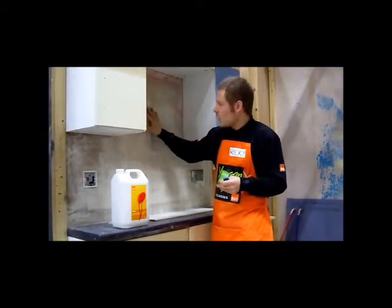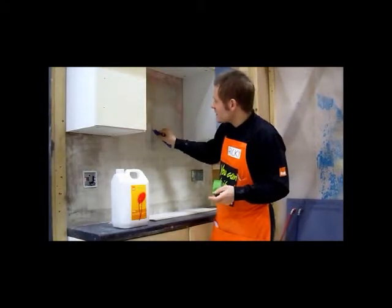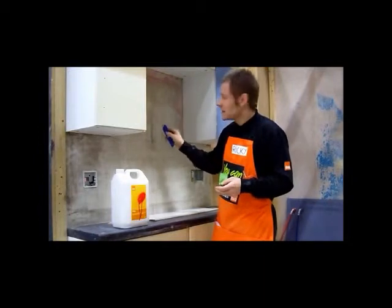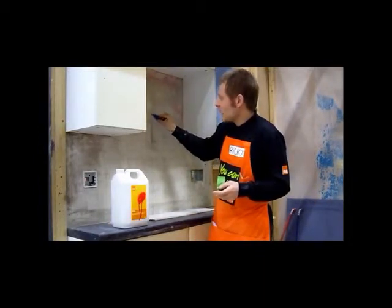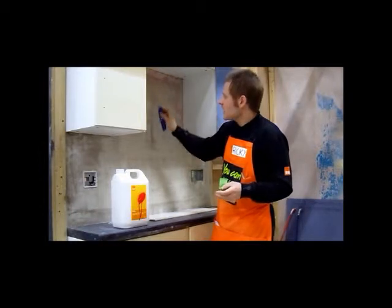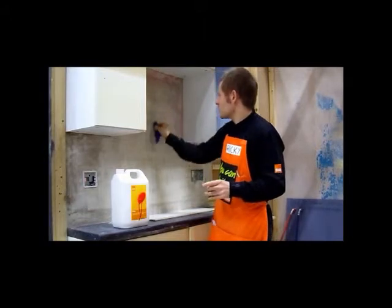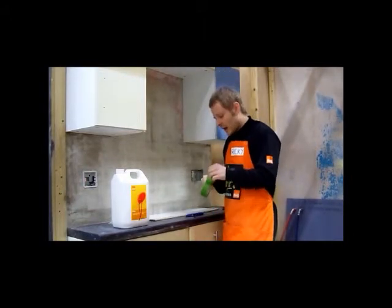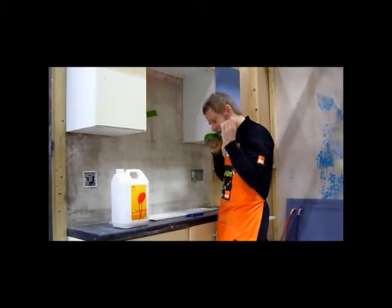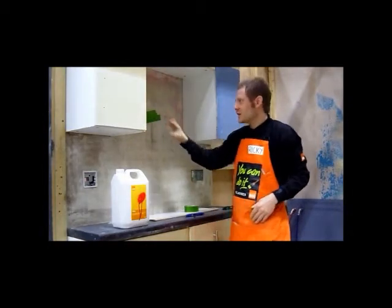We're going to pretend this wall has been painted. What I'm going to do is take a standard household key and create a series of lacerations — scoring in a brisk cross-hatch fashion on the paint. I don't want to make the incision so deep that I'm penetrating the actual plaster beneath; I just want to score the top surface of the paint. I'll do that in about six or seven spots across the wall. Then what I do is take some masking tape, or frog tape as I have here, and cover those lacerations over. I'll make sure the tape is pressed down nicely and firmly across all six or seven spots.